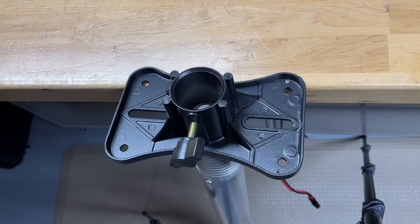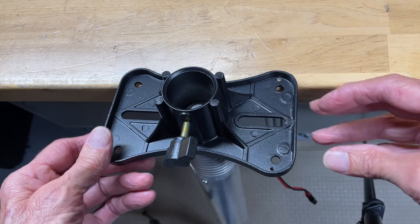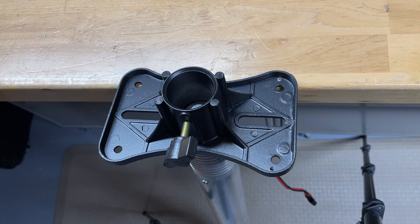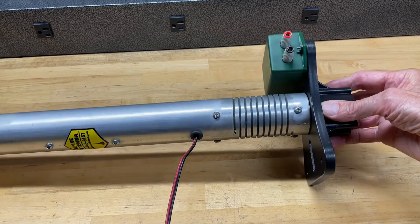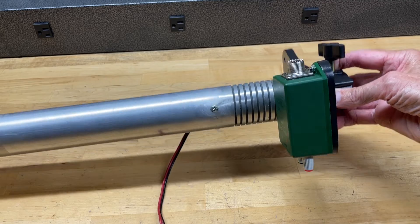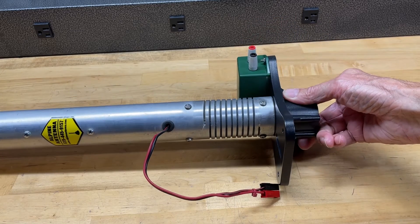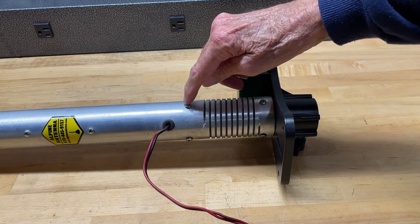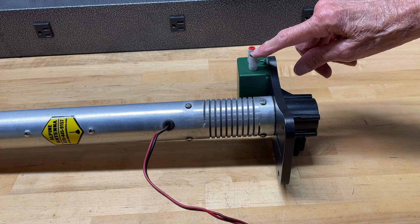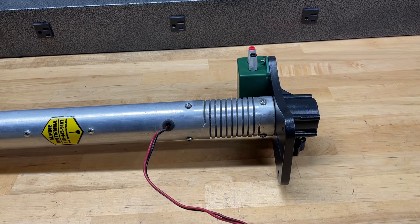Here's the speaker mount after I mounted it to the base of the antenna. You'll be able to see the bolt down in there that goes through and attaches to the base of the antenna — that worked out really nice. I've got the balun mounted on there as well. It turned out pretty good, with plenty of room and doesn't get in the way of anything. The next thing we need to do is connect the balun to the antenna — we take the hot side and put it to the screw over here, and then the ground side to the screw here on the ground side of the antenna.